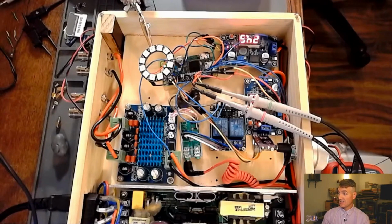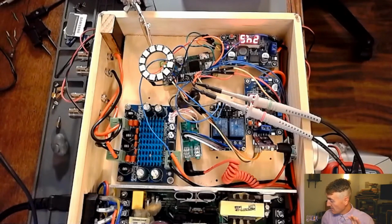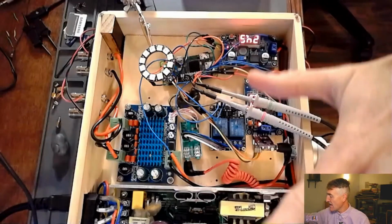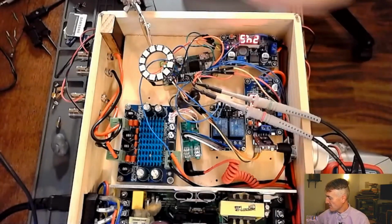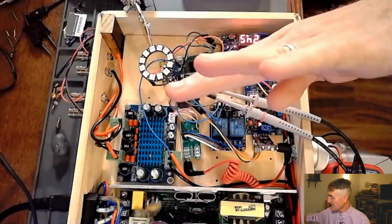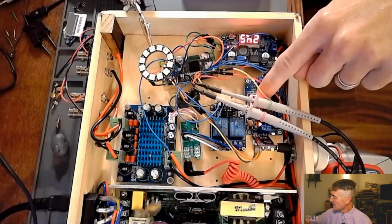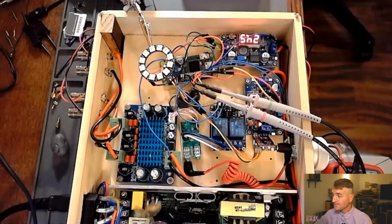One other suggestion was about the angry cicadas I have been struggling with. It's actually EMI noise that is leaking from my Raspberry Pi and getting everywhere in my system. I solved that by isolating the Raspberry Pi onto its own power supply, this DC to DC regulator, and putting my analog section over here, spaced apart by distance. And then I have a separate DC to DC adapter that is powering my little DAC chip.